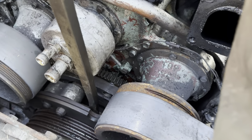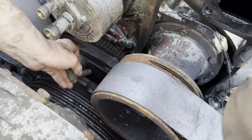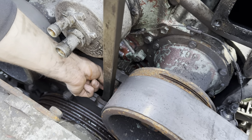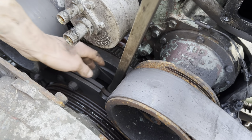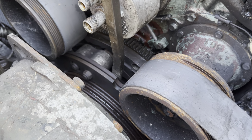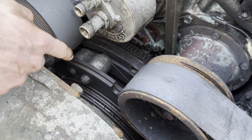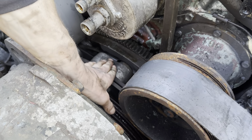Okay, so dowel number two. Can you see the dowel? Yeah, you can, just there, look. Right, so we'll put that bolt in, just to put it back. Okay. Like that. Dowel disconnect, now just do the test, just pull the flange away. Alright, so now if you turn the flywheel now, it should be able to turn free of the gearbox. There we go. Perfect.